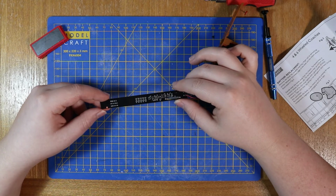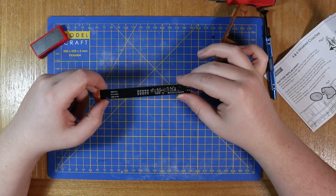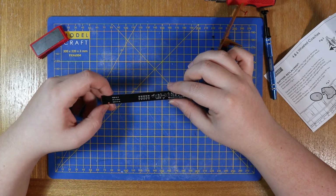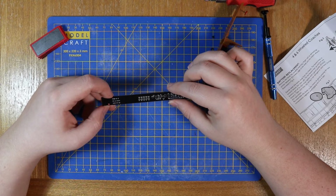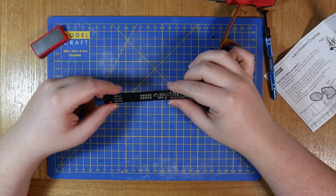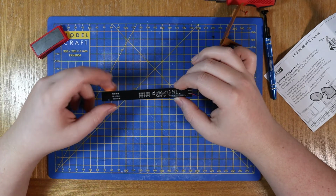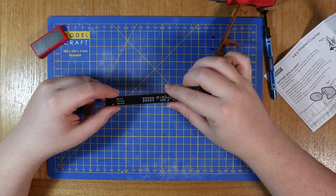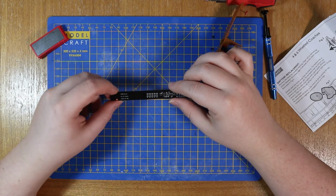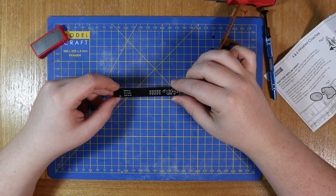I mean, 6 maybe something to do with it being a 6-wheel coach. I absolutely have no idea there really. I do see underneath it says FR4 equals 1mm, so FR4 is the material type. It's what PCBs are made of, like a fiberglass based piece of 1mm. Yeah, it's about 1mm thick, and I think underneath that then is like a production date silk screen there.